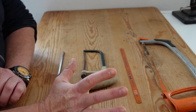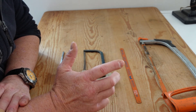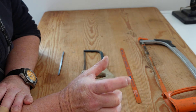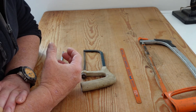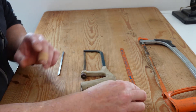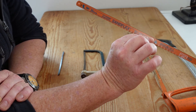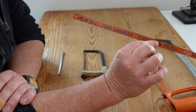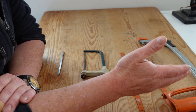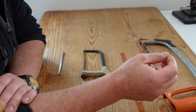The other item I missed was just talking briefly about the number of teeth per inch on the blades. Generally speaking, hacksaw blades come in 14, 18, 24, and 32 teeth per inch. The 14 TPI are quite spread out — they're for soft materials like aluminium or copper. The 18 TPI are generally regarded as a general use blade. The 24 TPI, which these particular ones are, are designed for cutting steel up to five or six millimeters, or slightly larger for round stock. The 32 TPI are designed for cutting tubing like water pipes or copper pipes where you need a quite fine cut. Obviously the more teeth per inch, the finer the cut; the lower the TPI, the more coarse the cut.